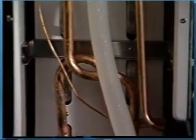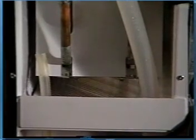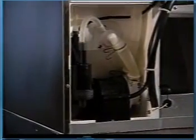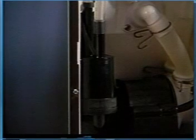After 1 minute, the controller board checks to see if the float switch is closed, and if not, repeats the fill cycle until the water level is sufficient. The float switch check also occurs at the end of each harvest cycle to ensure continuous automatic low water safety. When the switch is closed, the controller starts the initial harvest cycle, which runs approximately 2 to 3 minutes depending on ambient air and water temperature.